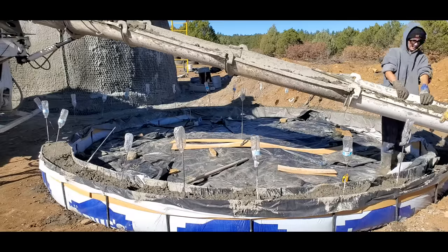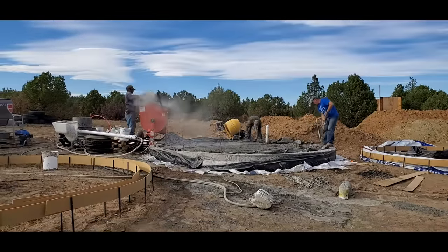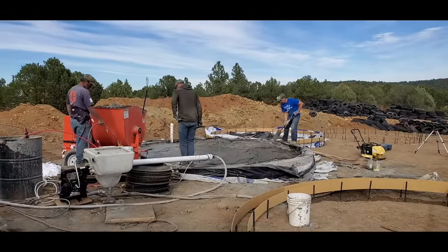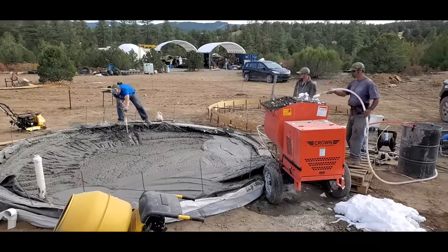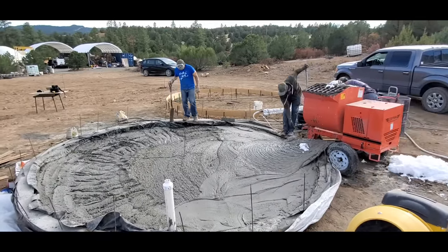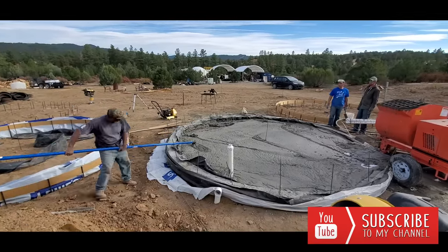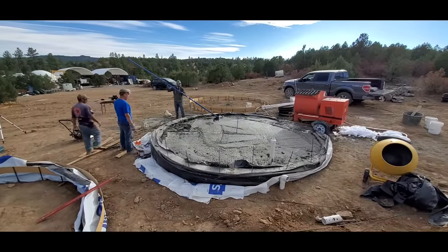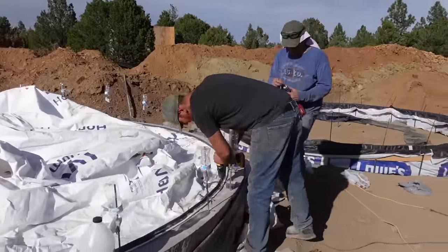The wood and house-wrap plastic held — it worked. The slab you see here is actually the very first one, and once I saw it worked, I felt confident enough to repeat the process, make some improvements, and order a cement truck without worrying about my forms blowing out. That was a big concern. After doing this first one, it gave me the confidence the system worked and I was able to move on. Here we just mixed and poured 1,200 gallons of aircrete into the slab.